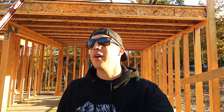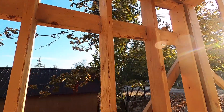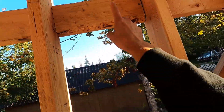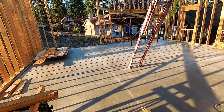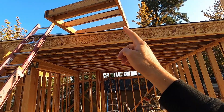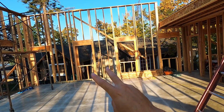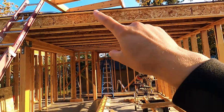We are back! Good morning — well, good morning for me, good afternoon, evening, or night for you. This is where we left off last night. We are hanging these pieces right here, and what these are for is — it's quite a ways down to the ground — but what these do is give the sheet a place to die off. We're going to be putting up OSB sheeting all the way around the shop, and that gives it more structural rigidity and helps keep the building square. It gives it shear strength, and once we get this sheeting done we know the building is square and we can call for our trusses to have them fly those in.